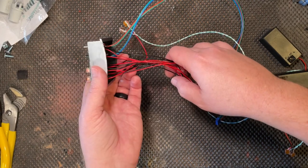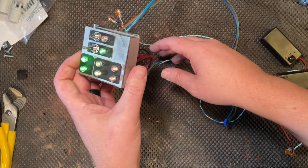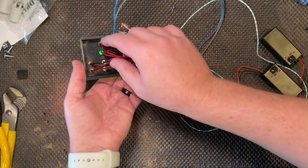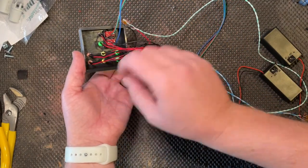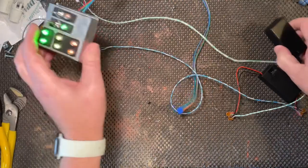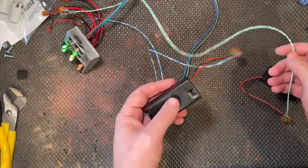I installed a set of plastic lenses for each of the lights and installed those in there with a dash of hot glue to hold the lights in, since they're smaller than what the lenses are intended for. I ran these in series — four LED lights each — and I'll go back to this nine-volt battery box.